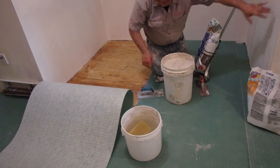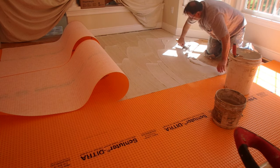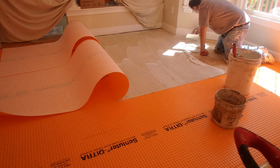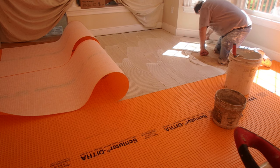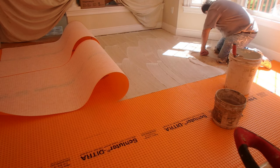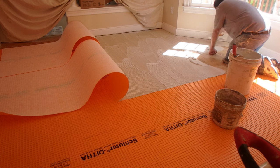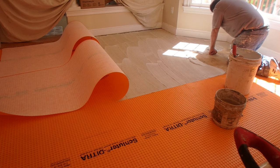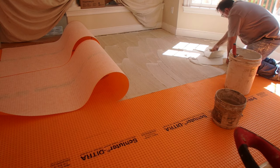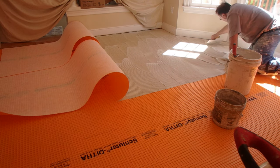So which membrane should you use? My suggestion would be to stick to a major brand — that way you have the backing of a large company, and these companies do stand behind their products. If you have a favorite brand, whether it's Schluter, Ardex, Laticrete, Mapei, or some other brand, go with that company. They all provide the same benefit: they uncouple the tile from the substrate, absorbing a certain amount of movement to protect the tile from cracks due to substrate movement. Wood moves quite a bit with changes in temperature and humidity. Concrete moves more than you think — as they say, there's only two kinds of concrete: concrete that's cracked, and concrete that's going to crack.